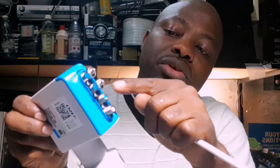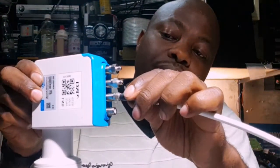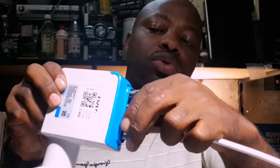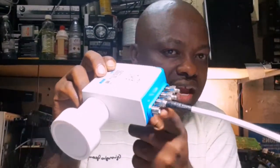Take the same cable that was working on your single LNB. On the smart LNB you have three uni-cable ports and one universal port. Do not use the universal port — the universal one has a white color. Choose one of the blue-colored uni-cable ports and screw your cable there. Then go back inside.